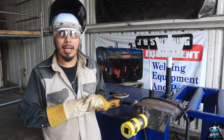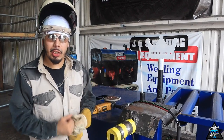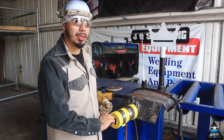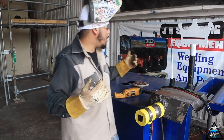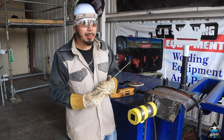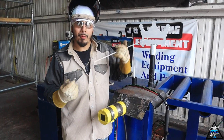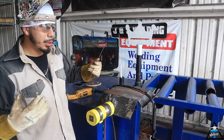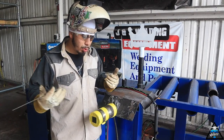We got our purge flowing. An easy way to check your purge is to lick your knuckle — if you feel cold on your knuckle, that means you got a good purge. For the technique today on this three-inch pipe, I'm gonna do the drop-by-drop method. On a small pipe like this, it's better to go drop-by-drop so you can get good wetting all the way around. For a bigger pipe — six inch, eight inch — I tend to just run it like carbon.